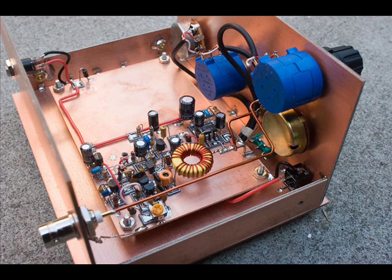I think it looks really neat in the photo, the way it's bent — a bit of a hark back to old-time radio. But what I found was that the RF attenuation control didn't attenuate an awful lot, because when it was turned to minimum, that stiff copper wire runs pretty close to the main coil, the main inductor on that toroid. So it was still picking up a lot of signal just from induction, just from the proximity of that stiff copper wire. I wanted the RF attenuation control to actually attenuate, so I substituted that stiff copper wire for just a piece of coax. It doesn't look quite as good, but it's actually a bit more effective.